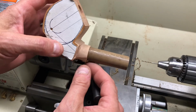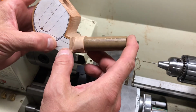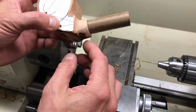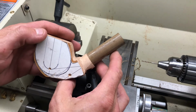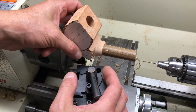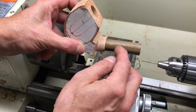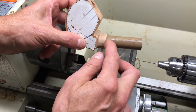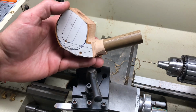So now what I think I'm going to do is chuck the pipe back up. I could have made the stem first, but I chose to do it this way. Since I don't do this for a living, I don't have a real set way that I do it. But I think on this, I'm going to chuck this back up into the briar chuck. Then I can put my live center in this hole, so then I can take the briar down to match the diameter of the stem. And in my next video I'll be showing that.